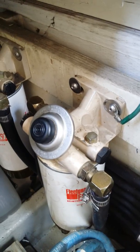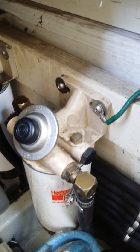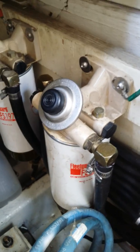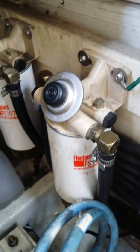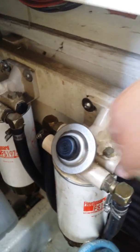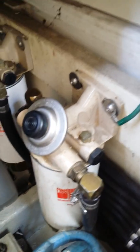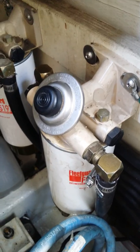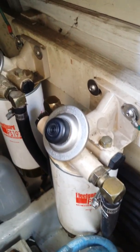I'd been planning to take this to a truck parts store to replace it, but turns out I didn't have to. I've got new fuel filter water separators on here now. I didn't have to replace the Racor housing, which is anywhere from $150 to a few hundred dollars — a pain to get and wait for. All I had to do was turn it over and pump it while it was sitting down there, and the engine runs again.